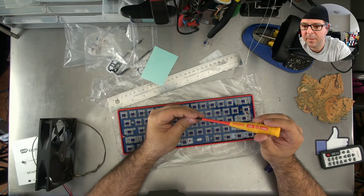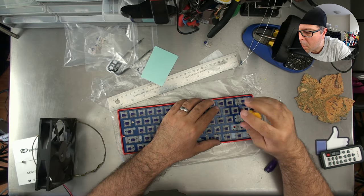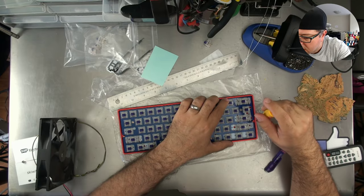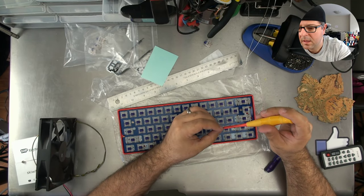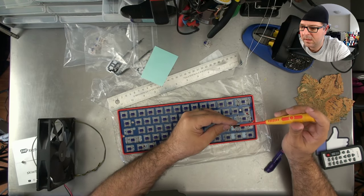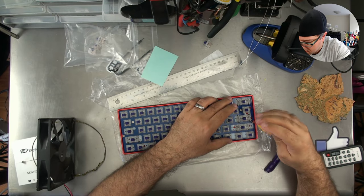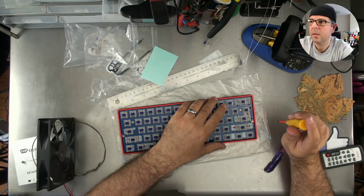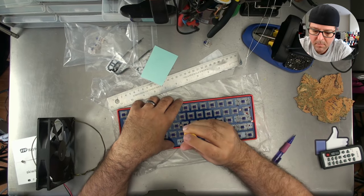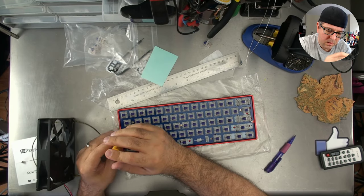Not something I'd ever heard of before, I'll be honest. I think what he's saying is that the top one is so warped that it's no longer parallel. It would have to be visibly warped, too, even with the 10 screws. So you're saying, is it possible to unsolder and check the switches again? Yeah, unsolder everything. It's the only thing I can think of if it's pulling. If one of them wasn't flush all the way, it would slightly pull?